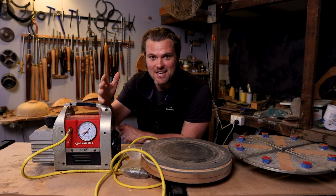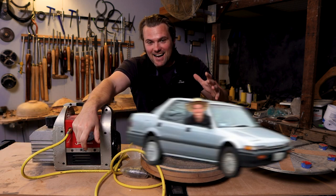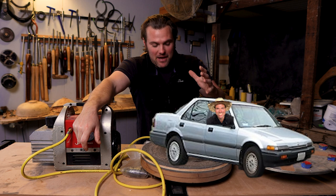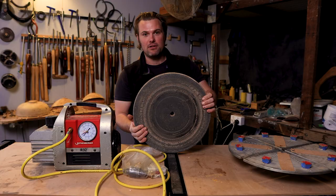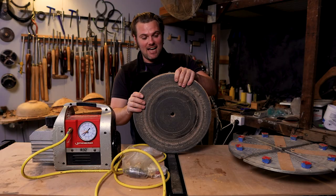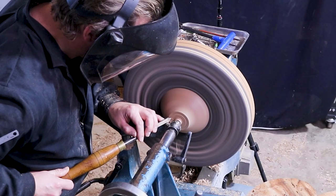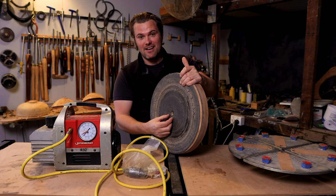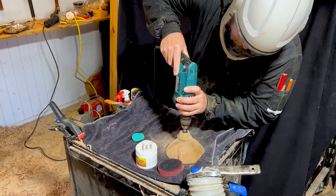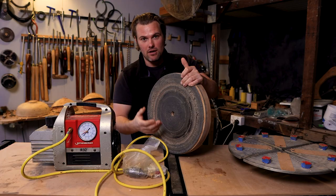I like to think of it as an analogy of buying your first car. So when you go out and buy your first car, you start with a plate — well, this is what I at least started with. You mount the bowl on the plate using the tail stock, you then turn the tenon down to a little stub, and from there you take it off the lathe, sand the stub down, and then apply your finish.